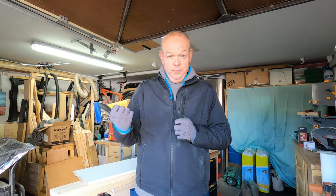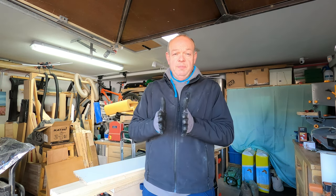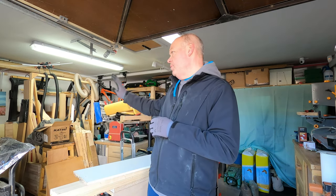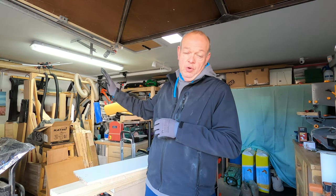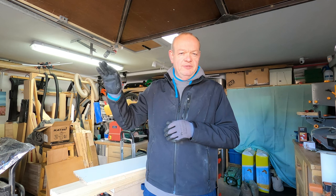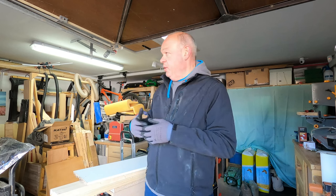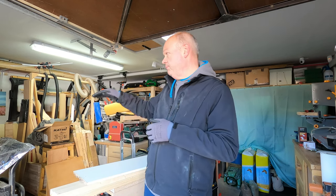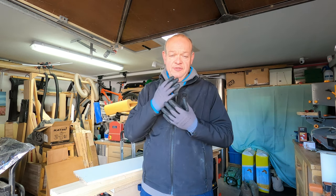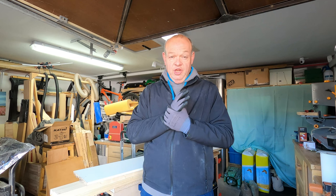Now this workshop is basically just a brick, a breeze block garage. So what I did before I started my YouTube channel was I plasterboarded out the whole garage using roofing buttons, much like a Straw Bale Workshops video — I basically copied his video, which has massively helped. But one of the disadvantages is I'm going into plasterboard that's foam-backed, so whenever I put anything on the wall I've got to be doubly, doubly secure that I know what I'm doing.